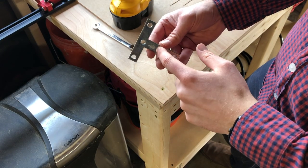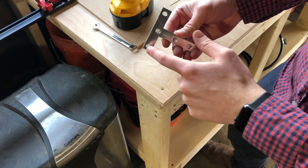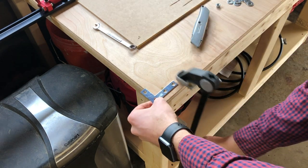These T-plates come pre-drilled with quarter-inch holes, which are fine for the two holes that will go on the T-track. But I actually need 5/16-inch holes for the two that will be on my track saw track, so I'm going to drill those out just a hair bigger now.